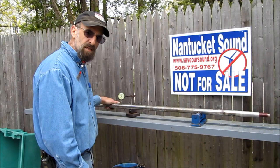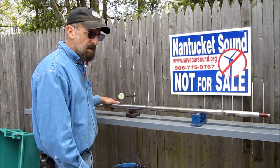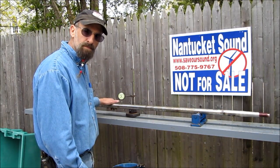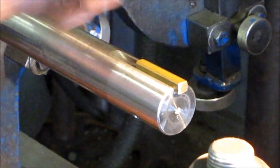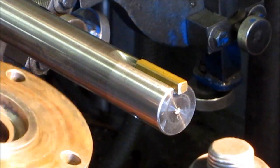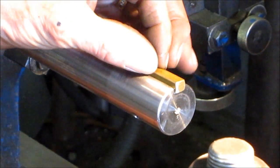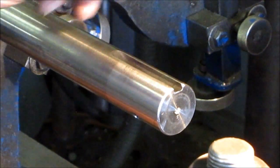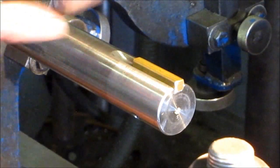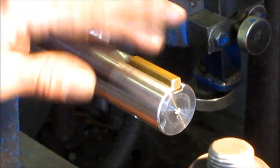It's a solid bore coupling and we've got to check the fit and the integrity of that fit. The shaft has been here about four hours and it's almost ready to go back in the boat. Getting ready to assemble the coupling — it had a good fit. I cleaned it up, got the key to slide freely through it. Now I want to point out: with a brand new piece of key stock, if you tapped it, it would bounce out. I'm going to show you how to make this key fit tight in the keyway.